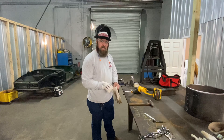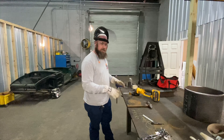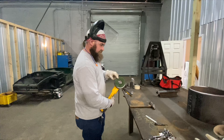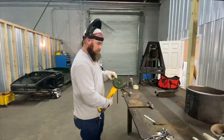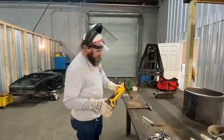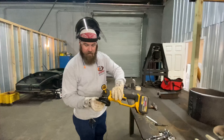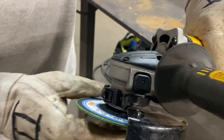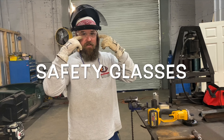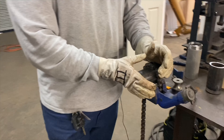We're going to go over some basics for beveling. Every Tuesday we make all our students bevel their own pipe — it's Two Inch Tuesdays. A few things about this grinder: we use these Chanta discs, they work real good, they're green and take off a lot of metal. One thing you want to check before you get started is if this guard is properly installed and tight. There's a set screw right there to tighten it. Safety features to watch out for: safety glasses, grinding shield, and earplugs.